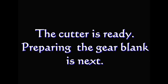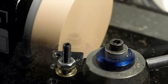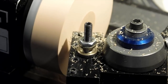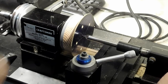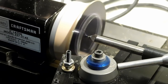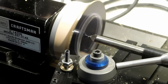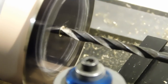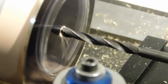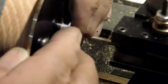Let's go ahead and start making that gear blank. For this one we're going to use an oak arbor — it's already screwed to a face plate. We'll face off the edges. Because of that big single-point cutter we're going to be using at full depth, we really need to hold it tightly, so this is the best way to do it. Now we're bringing the OD down to the size we need. We'll center drill it, use a drill bit to go a bit deeper, then do a little boring to get that last thou off and get the center in there nicely.